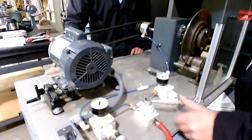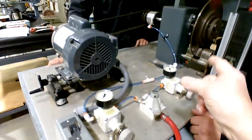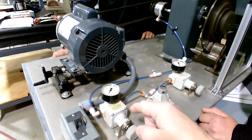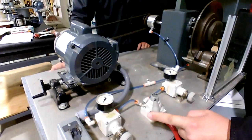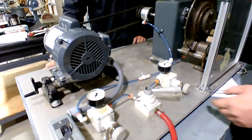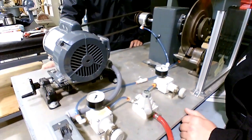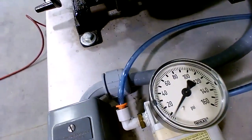All right, do that again. Go to the left. You got a very soft. Well, don't push it like that. You want to let it do it itself. If you have to tweak the clutch area, you can, but let it do it sort of on its own. So you're engaged now. Now go to the right to do the brake, and that's a very smooth controlled stop. Now start it again one more time. So that tells me that you need just a pinch more air, just a smidgen.